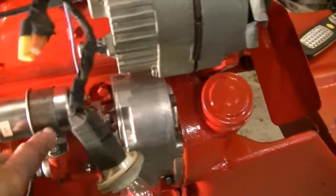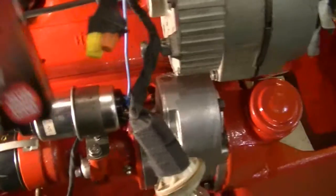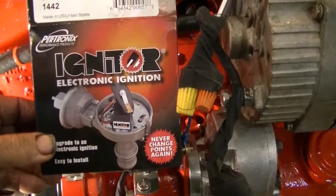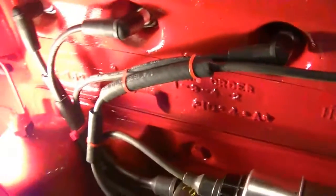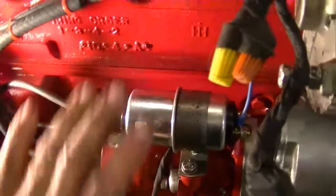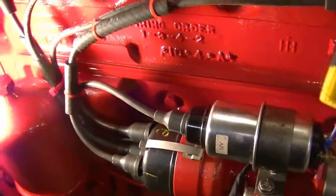This will light until the alternator is charging, at which point the light will go out — confirming it's working. From the key, we've got a line going down to the coil, and we're using electronic ignition. We've got new ignition wires with slotted hose around them so nothing can arc or spark. Eventually I'll put a piece of inner tube over the electronics since this tractor sits outside, to keep the rain off.